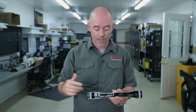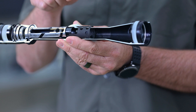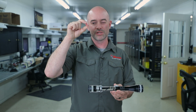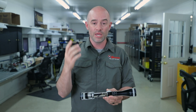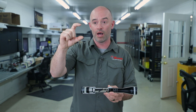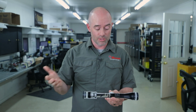That's where front focal plane comes in. If you look at some of Burris's premier products — the XTR2s, the XTR3s, the Veracity lineup, and even our Eliminator 3 where we did a digital front focal plane — that idea is that everything stays in proportion between the reticle and the target. Using the same example of my index finger and my thumb bracketing that picture or monitor or window, now if I zoom in and out by bringing my fingers closer or farther away from my face, what if I made them larger and smaller so they always fit that object? That's a front focal plane — the reticle grows and shrinks along with the target. The beauty of that is it makes those holdovers accurate anywhere. If I say my thumb is my 300-yard holdover mark and my index finger is my 100-yard zero spot, and it goes in and out together, then whether I'm at low magnification, high magnification, or anywhere in the middle, that 300-yard holdover is true no matter what. That's why a front focal plane can be a big advantage if you're using ballistic dots.